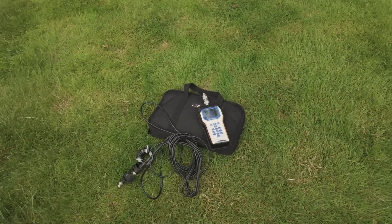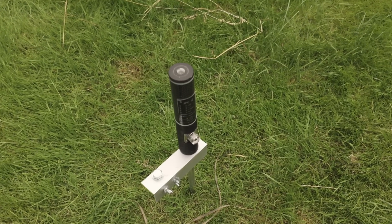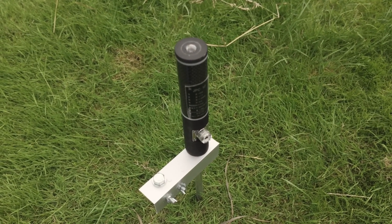Here is my kit of parts with the JPC12 and the antenna analyzer. I've made a bracket for the base so I can easily attach radials. If we have the radials off the ground, we get something like 2 or 3 dB improvement in signal, and also, as I explained, if that radial is pointed in a particular direction — using a single radial — we get a little bit of gain.